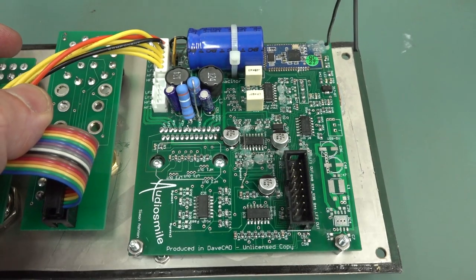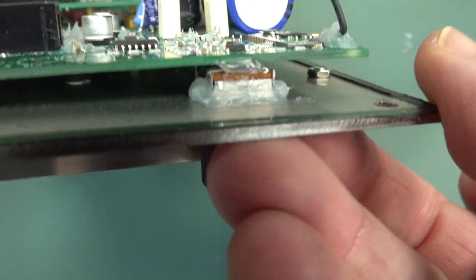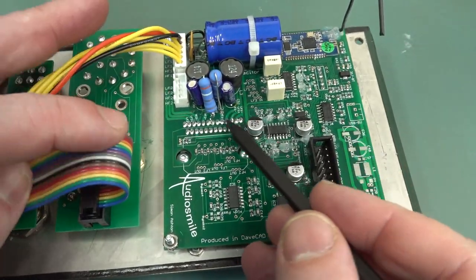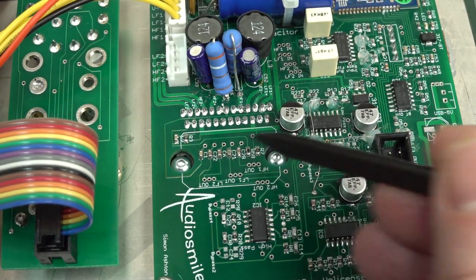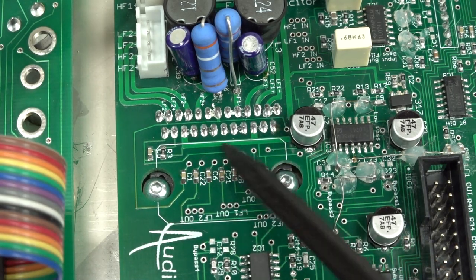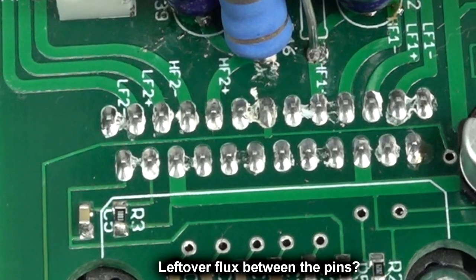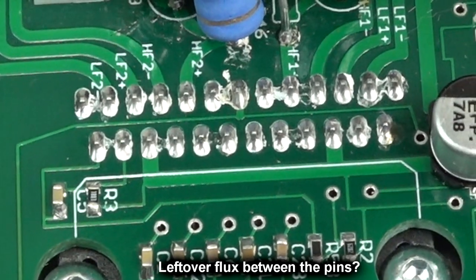So I'd love to get the rest of the board out, but unfortunately things like these switches are all glued in and soldered right angle like that, and the power amp, of course, is under here. You can see the two screws there holding that down. So that's a dual row, single in line package bolted down. It's a Class AB, none of this modern Class D rubbish, don't want any of that. So I can't get you the part number on that, but I'll endeavour to find out.